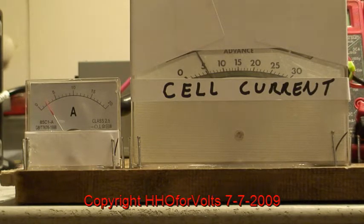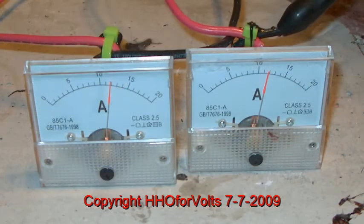The idea is to use three of these identical circuits, which should give at least 15 amps at full resonance, or close to 50 amps just coming out of resonance. But the heat from the rod will be tremendous, so we need some type of cooling. The next thing you'll see is the setup using digital meters, which are so much easier. If I had it to do over, I'd use a 5-amp scale on the power supply — we don't get close to 5 amps there — and a 10-amp on the cell current. I've calibrated these meters; they are equal.